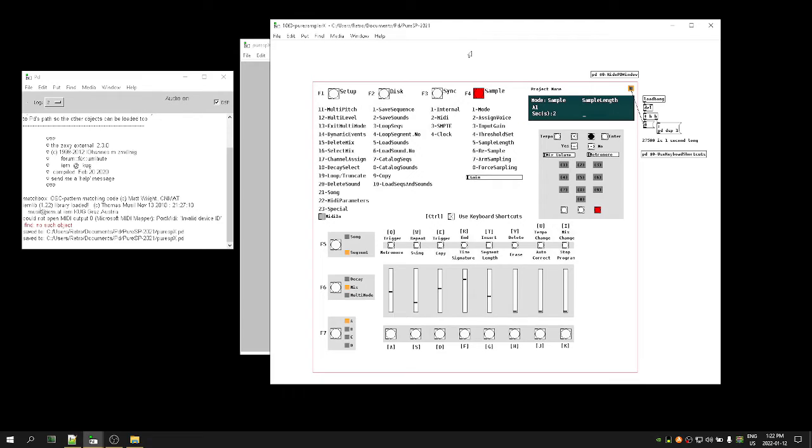We would then go to command 5 to set our sample length time — we'll go for about 5 seconds. This is currently unlimited, though I may limit it to allow for saving space on an Arduino, Raspberry Pi, or any embedded system, depending on available storage and write times. I might limit this to around 10 or 20 seconds, seeing as the SP1200 is I believe 5 or 10 seconds. So we set our sample length, and now we could actually record a sample. I click 7 to ARM, and now I should be recording.